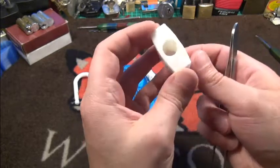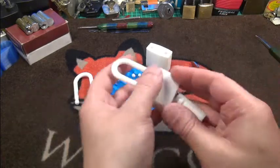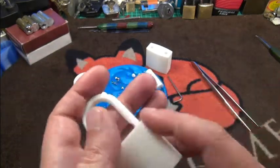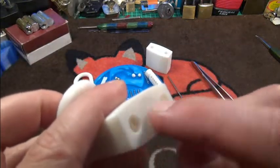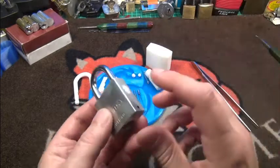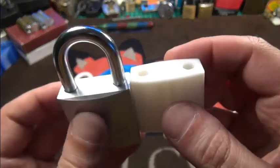And here I quickly show you the first prototype. Here the cut was completely around — the drill holes for the ball bearings were the same size on both sides. So I made those mistakes the first time. My first try to hold the shackle in was just molten plastic, but I learned from that. Also, the holes for the ball bearings were going all the way through. And the shape might be very familiar to you — this was the lock I took as a sample. Maybe you can see it here — not exactly the same, but you might get it.